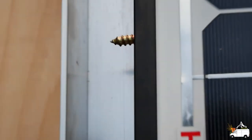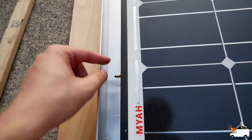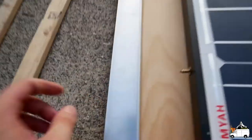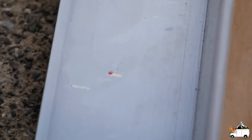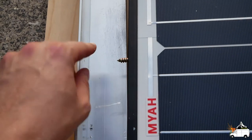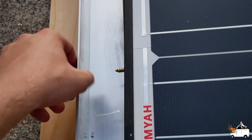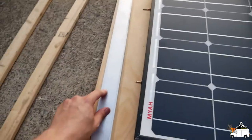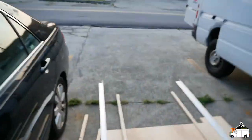What I did is I pushed this aluminum angle into the bolt and held it down flat — because there's a little wobble — and it made this little scratch. I made a little mark and did that up here as well. Then I flipped it back, lined it up with the mark, and checked if it needed adjusting. If it did, I'd wipe the marker away before it dried and put it lower, repeating trial and error until I got the holes basically lined up where I need them. Now I'm ready to drill the holes and do a test fit.